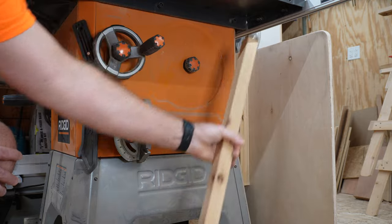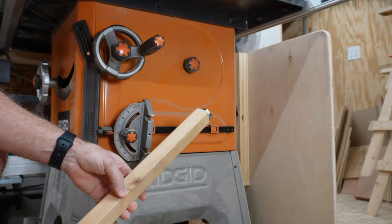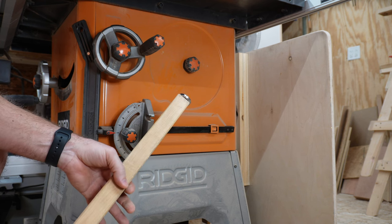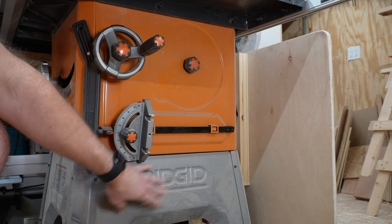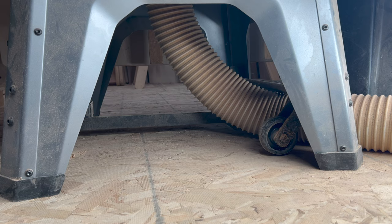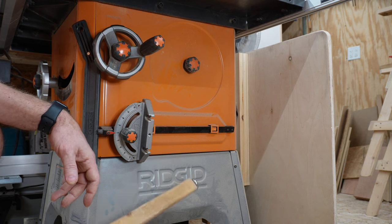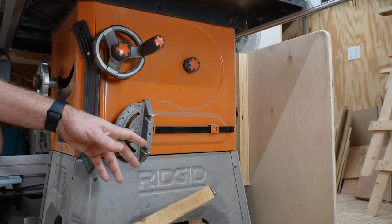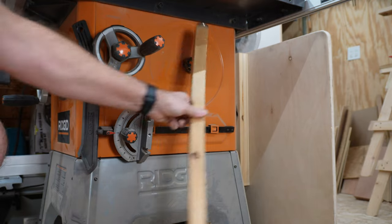This is my rescue stick — I have a magnet on the end of a stick just in case I drop the arbor nut inside the saw. There's a plastic funnel at the bottom underneath, and the dust collection hose is attached to that funnel. So if the nut fell inside the saw, it would fall into the beginning of the dust collection hose, and as long as dust collection isn't running, I can still retrieve it with this magnet stick.